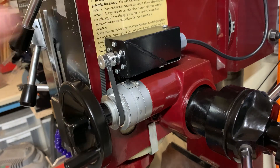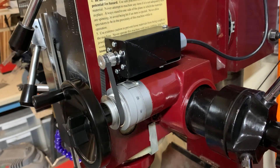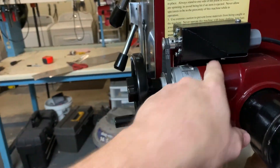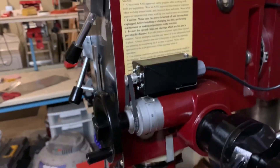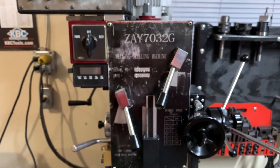The little box is really straightforward. It's a six-hole bolt circle that just mates up directly to the motor. There's a little removable back here — the piece with the bulkhead fitting comes off so that if I need to replace the motor I can do that. The entire assembly is simply on some slots with some socket head cap screws that I just drilled and tapped for into the head of the mill. Basically from this line downward, there's no oil or anything you need to worry about running into if you drill into the body of this particular mill, though yours might be a little bit different.